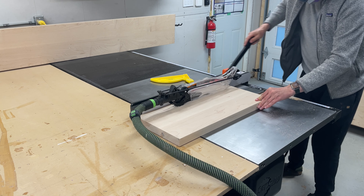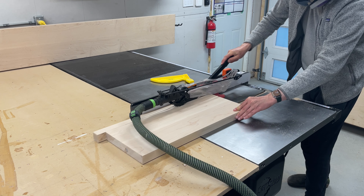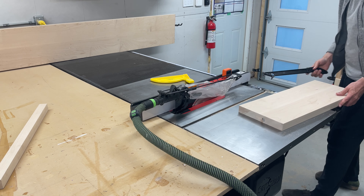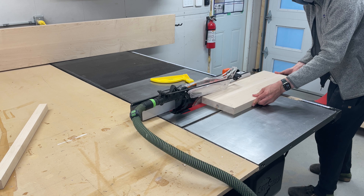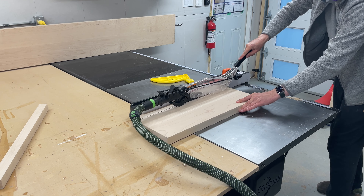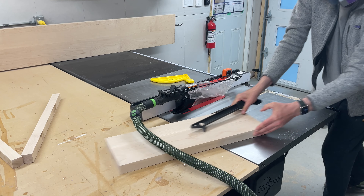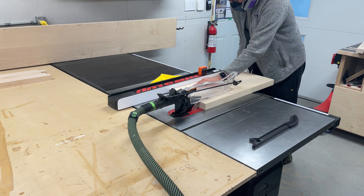A while back, I had made an 8-foot wide console table with waterfall edges that, after gluing up, twisted pretty bad. I ended up cutting the legs off and am using these as the start of this project. It's nice to not have to mill up rough lumber this time. These boards were milled down to an inch and a half thick for that last project, so to start off I'll be squaring up one end and ripping square strips for the four legs.